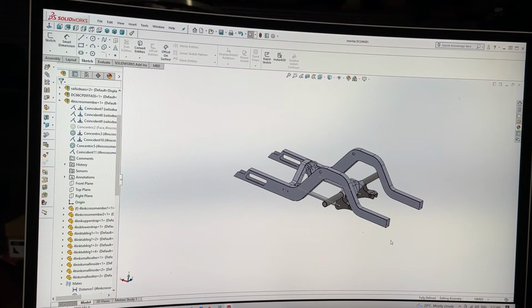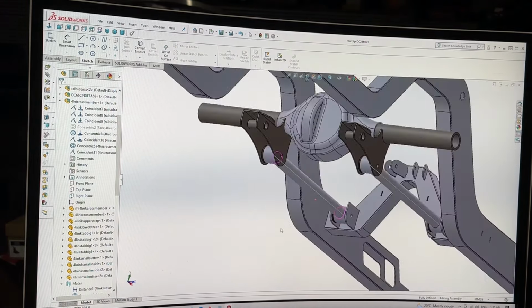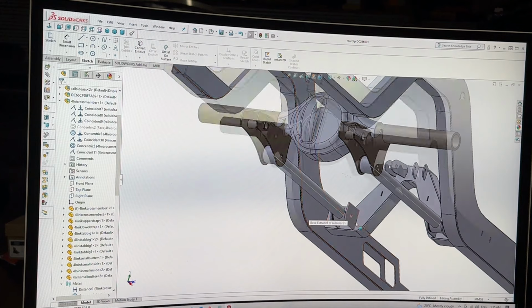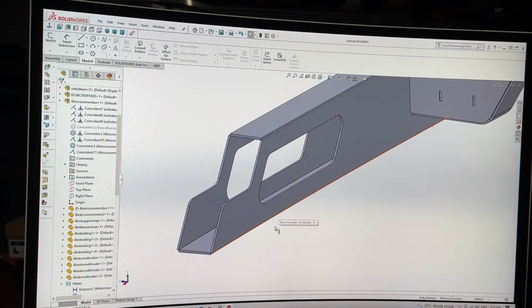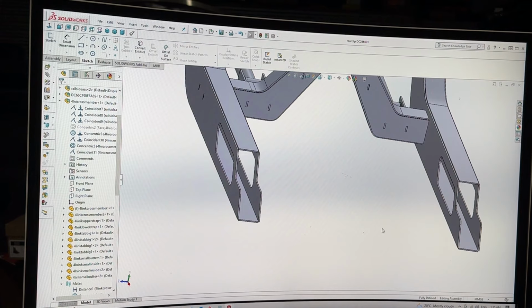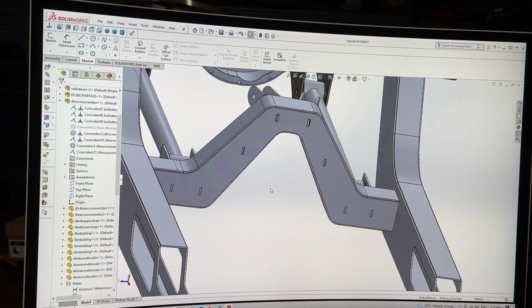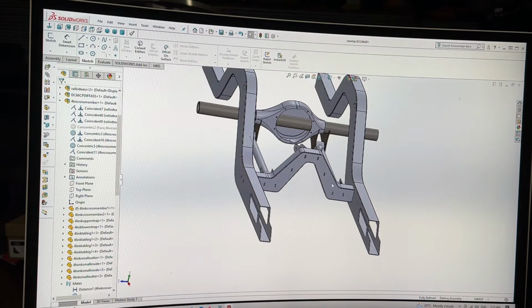All right, I've had some food. I even did some welding for one of my buddies on his little race bike. So that's all done, dusted, and now I'm back up here with a little bit of a foggy brain, but I'm pushing through it. Done a little bit of drawing off camera. I had to make some changes to the rail width because I didn't take into consideration the rail thickness. So that was a whoopsie daisy, but I found it, so that's fine. I changed the dimensions from the outside of the rails to the inside of the rails, and then that matches up to the stock rails perfectly. I then widened the cross member to take up that slack because obviously they're different.